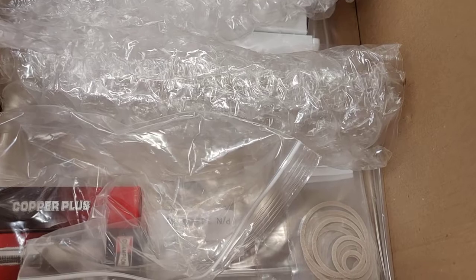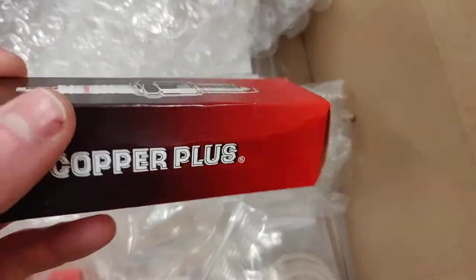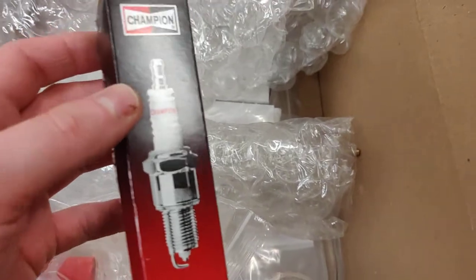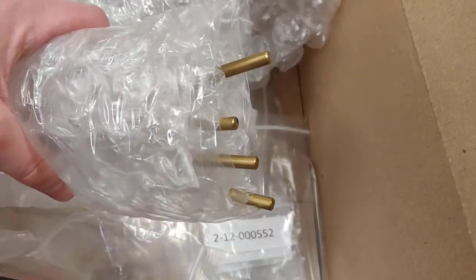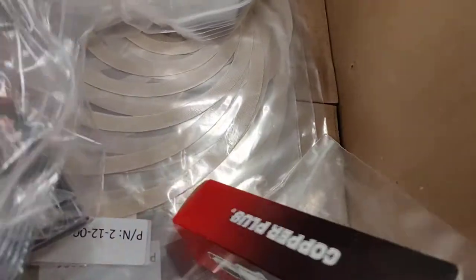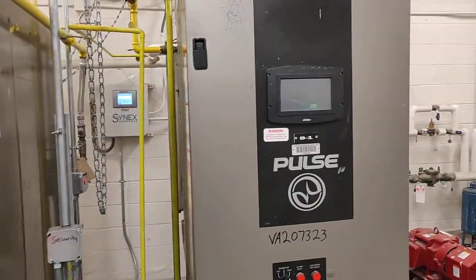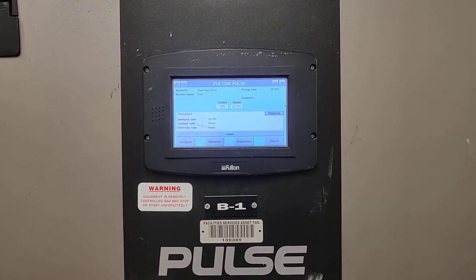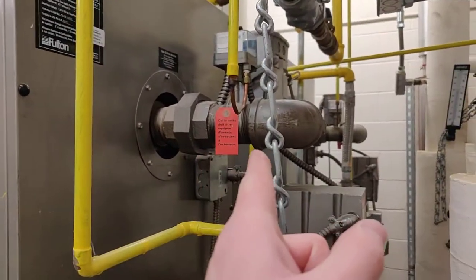Also unique to the pulse are the items you need for preventative maintenance. Here's your igniter — it's similar to an automotive spark plug. It will spark only during the initial light-off and then shuts off after the flame is established. You've also got water level sensors, flame rods, gas flapper gaskets, and down on the bottom are your air flapper gaskets. Those gaskets are what allows the thing to pulse in and out — there's a gasket on both the air side and the gas input side.